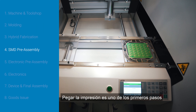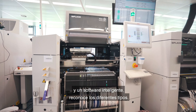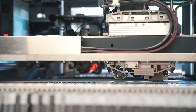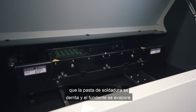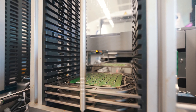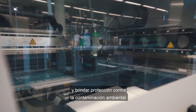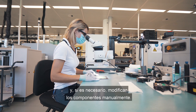Paste printing is one of the first steps in surface-mounted device assembly. The components are set up on rollers and an intelligent software recognizes the different types, removes them from the belt with the aid of vacuum pipettes, and then assembles them onto the circuit board. These boards go into a reflow oven for soldering where they are gradually heated until the solder paste melts and the flux evaporates, permanently connecting the components to the circuit board. Employees check the quality and, if necessary, rework the components manually.